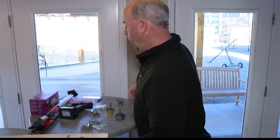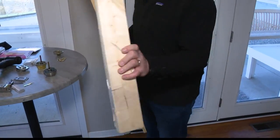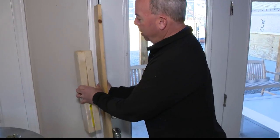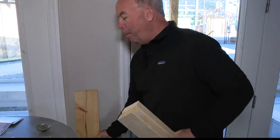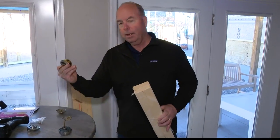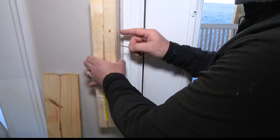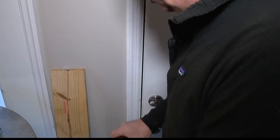There are some pretty easy things you can do. This is my example of a frame of a door. Right behind this wood is called the frame, the door frame, and behind it are the studs. You have all that wood back there. But on the standard deadbolt, this is the size screw — it never even makes it to where all the security of that wood is, because the screws are too short.